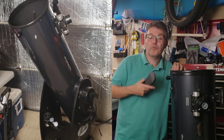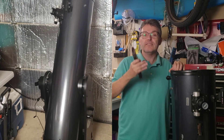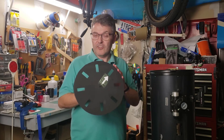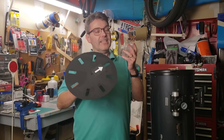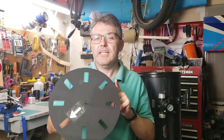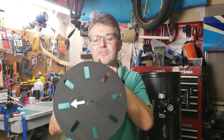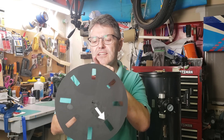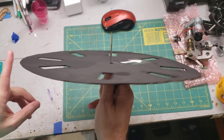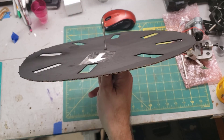In order for an automatic telescope to know where it's pointing or where it needs to point to, it needs to measure angles. Behold the encoder wheel. This one is much larger than you would normally see on any system, but it's this large just for demonstration purposes. The key to measuring how far of an angle you've moved through is to count the number of slots that have passed by a fixed point in space. Encoders use a very clever way of counting — they simply use a light emitter and a receiver.